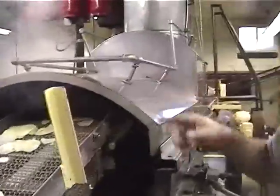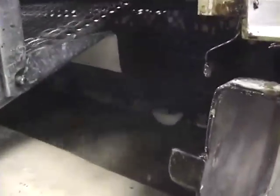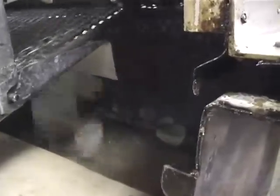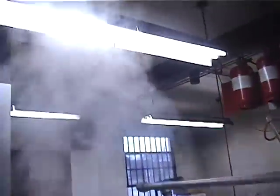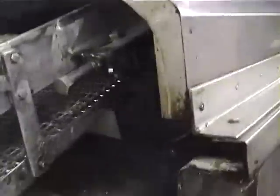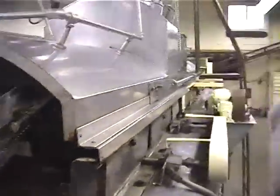This is the fryer — we're going into the fryer there. The water in the potato is getting cooked out, it's steamed, and it's getting replaced with oil. The oil is at about 330 degrees and the oil does the work itself. The chips are in there about 3 minutes. Sometimes we can mark a potato and track it — it takes about 8 minutes all the way through.